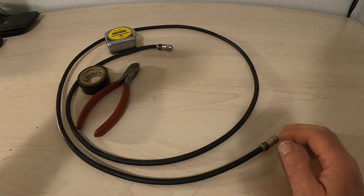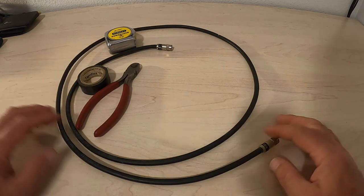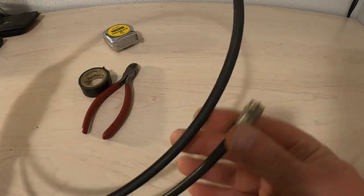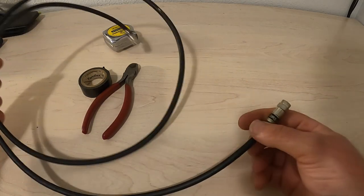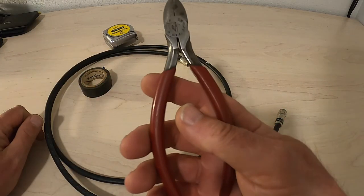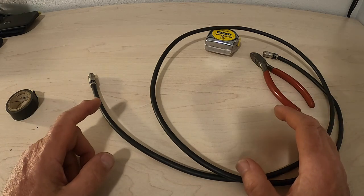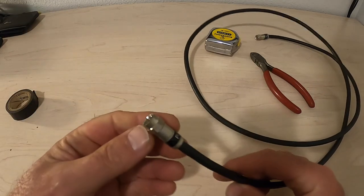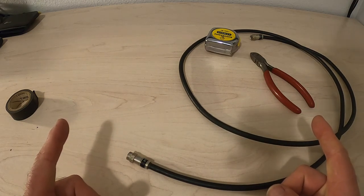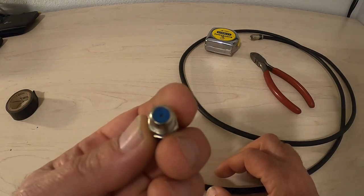It's a great idea if you're camped local to a city to have a little antenna out there. So what we're going to show you here is something you can do in 5 minutes, and it's basically free. I know that all of you have at least one of these sitting in a drawer. This is just a little spool of that cable that connects your TV. So what you want to do is you want a piece of this. You need wire cutters, a tape measure, and some electrical tape. First things first, we're going to make what's called a coaxial dipole antenna for those TV signals, and it'll screw on the side of your trailer. It'll stick out about 10 inches or so out of your trailer and work much, much better than any tinfoil thing, and better than that, it won't damage this connector. So let's get at it.